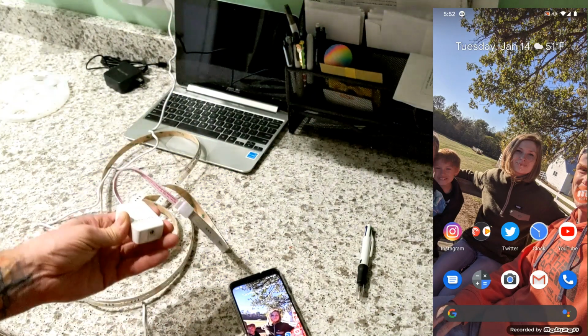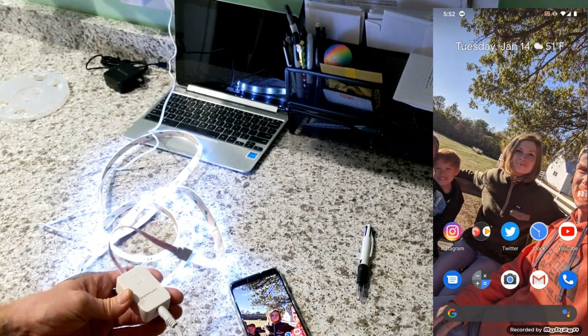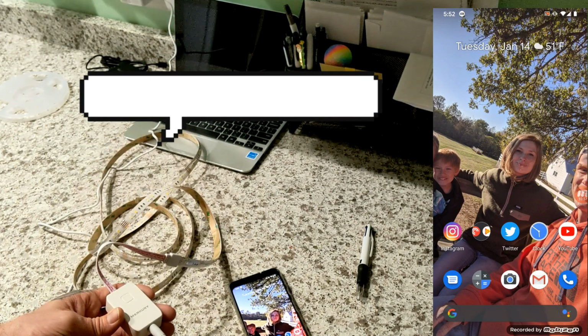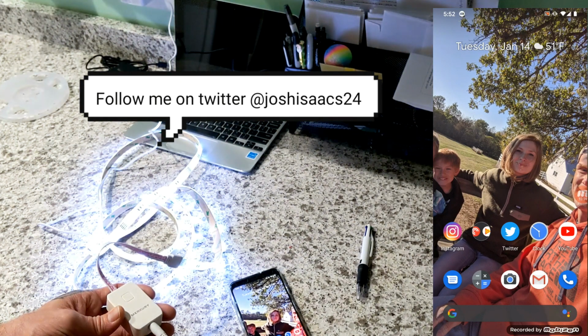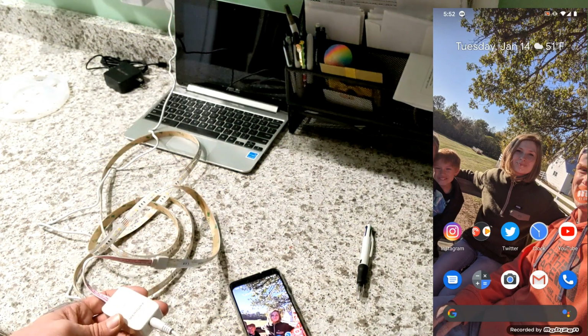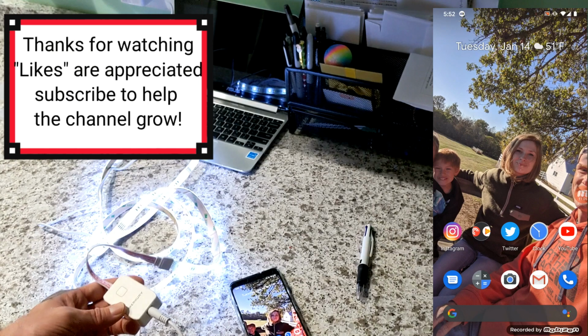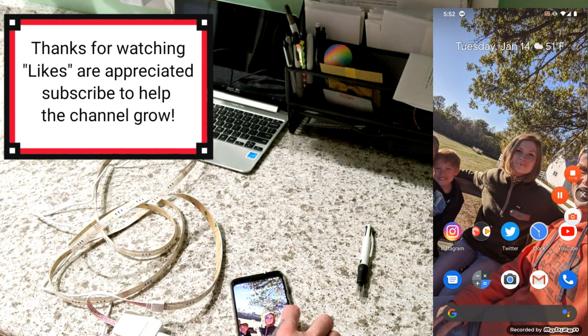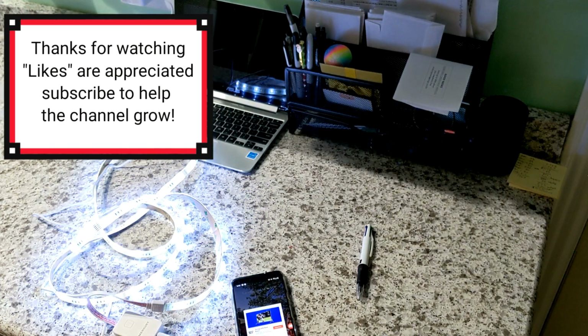And then again, I'm going to show the AP mode, which is a slow blink. Notice I did it 3 times once to get into the rapid blinking, which is the pairing mode, and then from that point I disconnected and reconnected 3 more times, and it got it into AP mode.